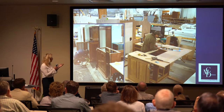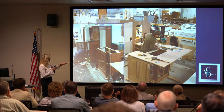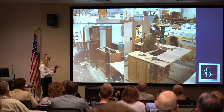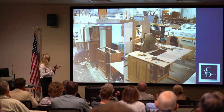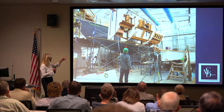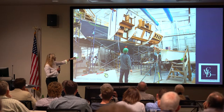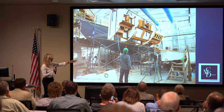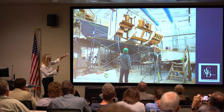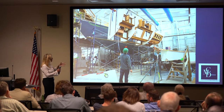This boat was the first time I'd ever done a boat built in modules. The work was done on the floor above where the hull is, and the advantage was that the guys were able to stretch out the space of the boat — doing stick-built construction where the companionway is six feet instead of two feet. Here you can see one of the modules going in on the port side: the guest head, guest cabin, and captain's quarters. The keel is on the boat at this point, the deck is being built, and the bulkheads were CNC cut, but everything else is pretty much stick-built.